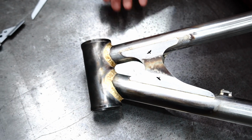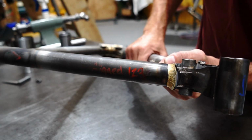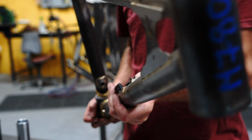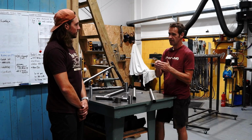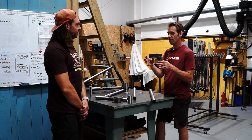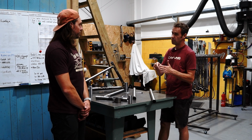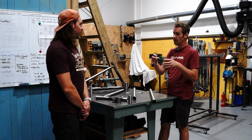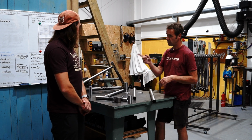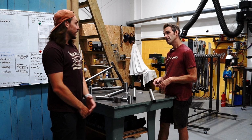Personally, I think brazing is better. My background was a stress engineer. I see a TIG joint, which is a very small, stiff joint, and you put a lot of heat in, and to me, it's a higher fail risk. It looks like something that's going to fail more than a nice, big, soft brass joint. If you're joining things together, putting a big, soft thing in there is actually good. It makes it more damage tolerant. Well, you've got a stress background as well, haven't you? Sure, yeah, less high stress points.